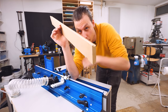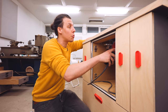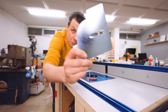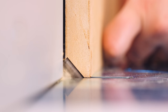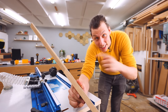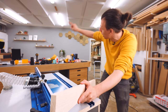That's a pretty standard thing to do with a router, but this thing has a couple more cool tricks up its sleeve. The whole router itself can actually tilt backwards up to 45 degrees. That will offset the router bit really far backwards, so there are two more handles in the back which allow you to adjust the whole router backwards and forwards. Then for the top, there's a set of plates with slotted cutouts that will perfectly fit onto the router. That's a pretty big chamfer and I didn't even need a chamfering bit.